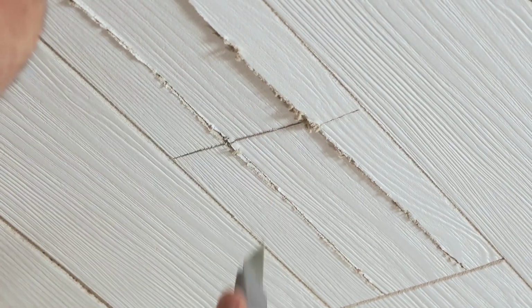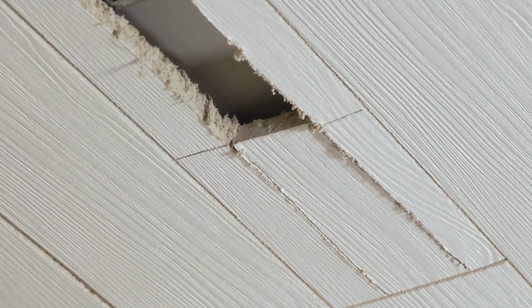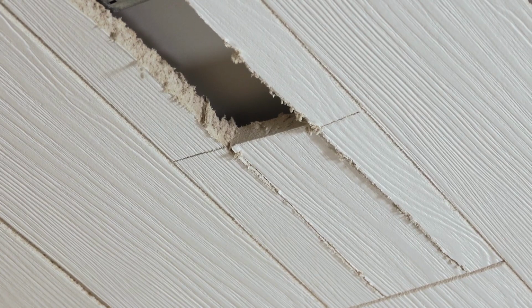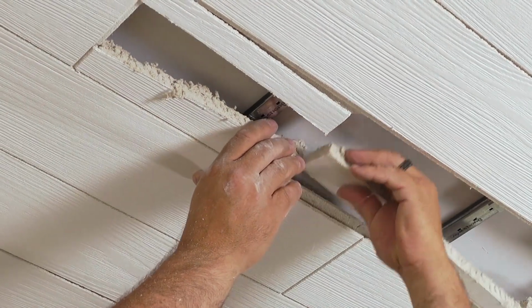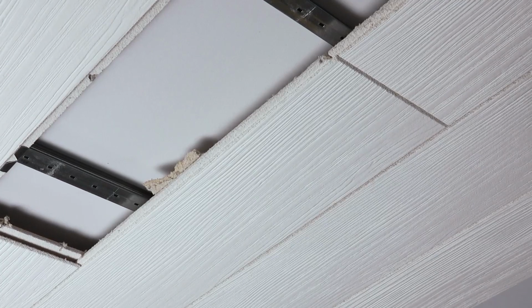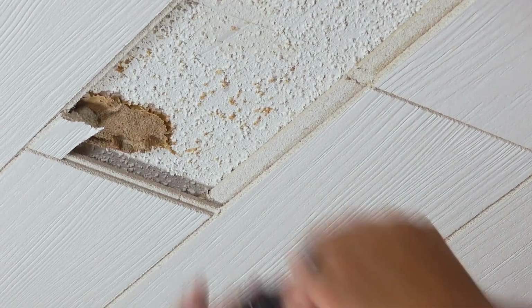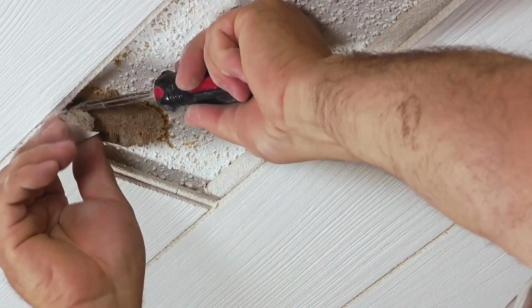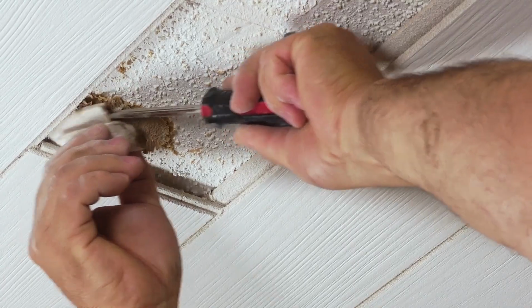After the cuts are made, remove the center section. One at a time, slide the remaining plank sections toward the open center and let them fall out. Be sure to remove all the damaged plank pieces. If the plank contained many staples, be sure to remove broken or hidden flange pieces behind the adjacent planks.